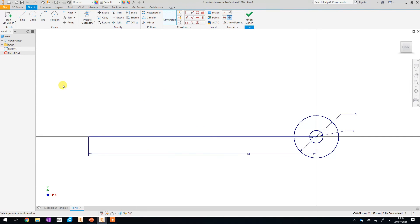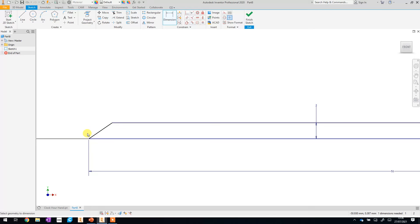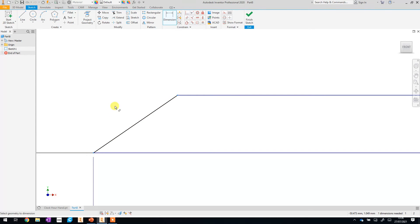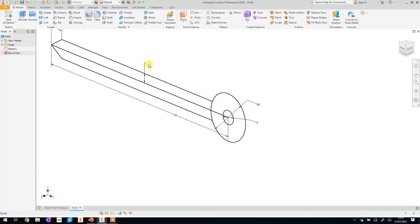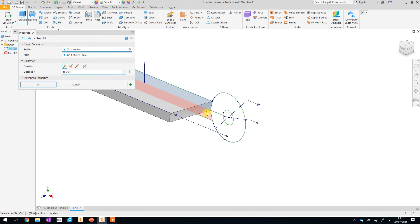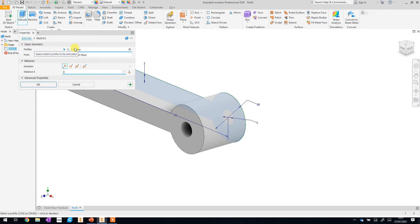The length of the hand is 46, but we're going to add on the extra five millimeters to start from the center, so it's actually going to be 51. Back in Inventor, start a line from the middle, go straight out and click, then use the dimension tool to set that to 51. As before, create two new lines — one coming up at an angle, the other going straight across to the circle. Using the dimension tool, click one line then the other and set the dimension to two millimeters. Zoom in on the end, click the red dots at either end of the line, drag straight up, and change that to three. Quick recap of the mirror tool: click Mirror, select the two lines, click the Mirror Line arrow and select the bottom line, click Apply, then Done. Finish the sketch, go to Extrude, select all three areas, and change the value to 1.5.